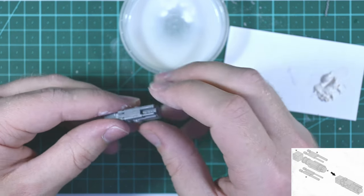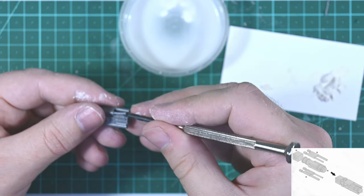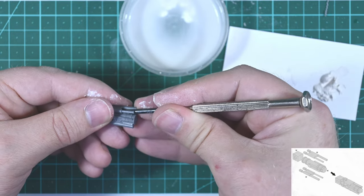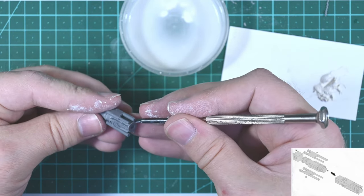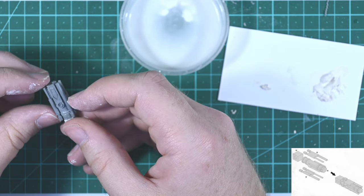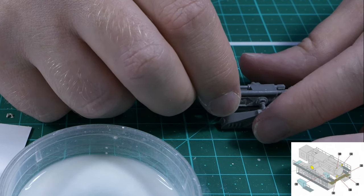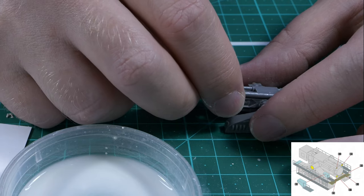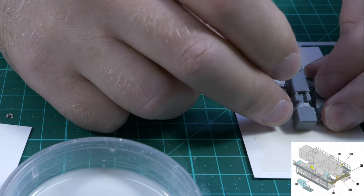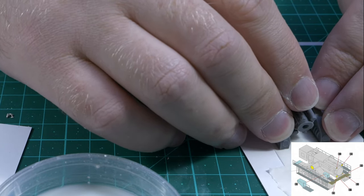The angles just don't seem quite right, so I'm going to spend some time making sure everything is level and in a position I'm happy with. Now that I've got the ends closer to the base of the metal barrel raised up a little bit, they look like they're sitting horizontally and this is starting to look a lot better. I'm still concerned about the symmetry of those hinge points, but at least at this point it looks square. So now it's time to do a test fit with the hinge. Clearly the holes are too small for the pins to go into them, so I'm going to need to open up those holes a bit.